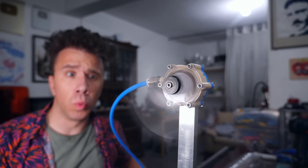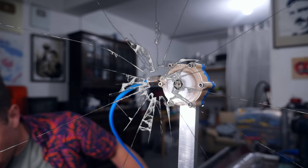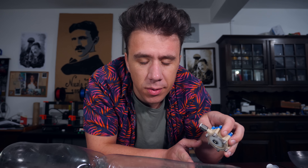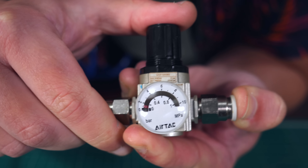Flappy engine test number one. The flappy engine concept is working pretty well — a little bit too well. The engine exploding made me realize I really need to stabilize the pressure coming out of the bottles, because I need a constant speed. So it makes sense to use a pressure regulator, set it to two bars, and connect it to the bottles. I'm going to design a new flappy engine that works well at two bars — the engine will also run for longer this way.